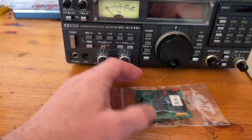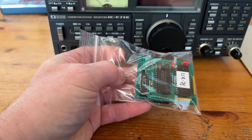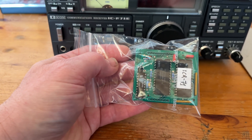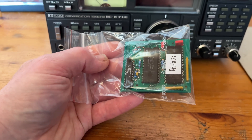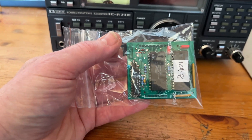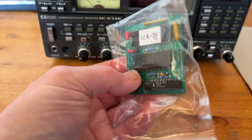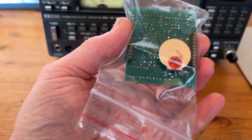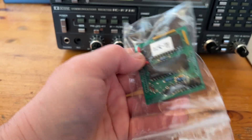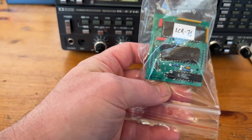If you lose the power to the RAM board inside this receiver, you have to go online on eBay and find a programmer. The programmer costs around €20 plus delivery, and if they come from China you're going to pay taxes too. There's a guy in Italy, Roberto Nardo, who has devised a new RAM board with a battery — but the battery is not so critical, because the programming is now on an EEPROM, so the battery is only for the memory. This will save you a lot of trouble, and it's well worth getting one of these boards.